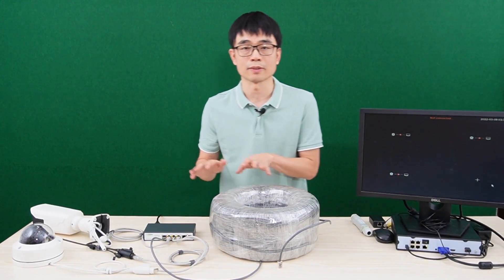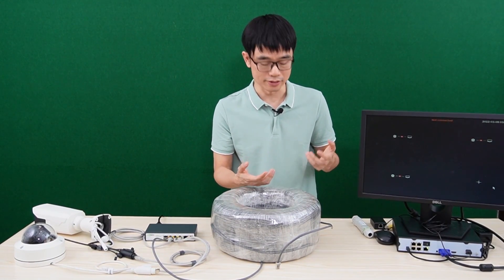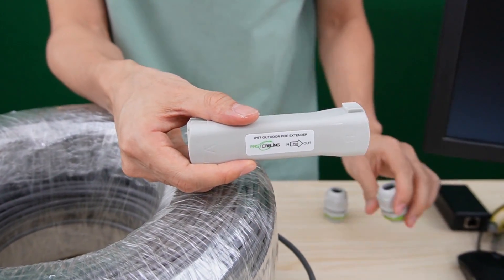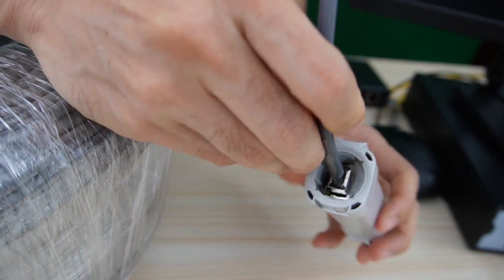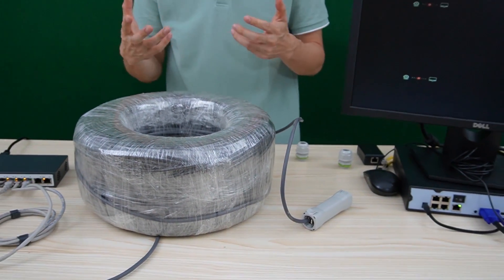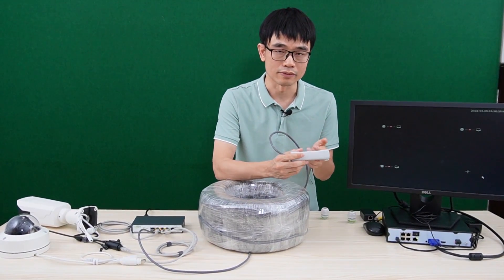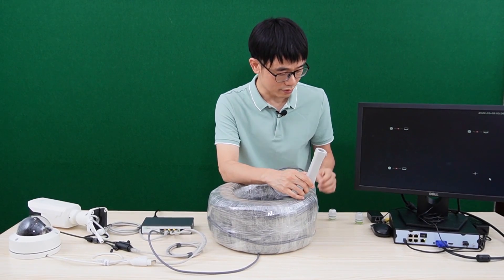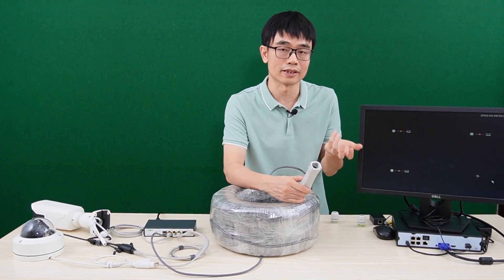The reason is, even though this switch can supply up to 1,000 feet long-run, the network video recorder is a regular recorder — it only supports 328 feet. So in this case, we also need this PoE adapter. In the standard PoE system, there is always power handshaking. Before this switch releases the power to this adapter, we need to make sure it's a PoE-compatible device, like a PoE IP camera or access point. If we connect to the network video recorder, it will not work because the NVR is not a PoE device — it doesn't need PoE power.